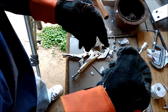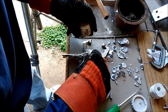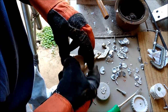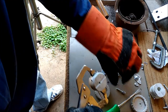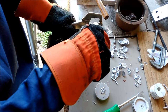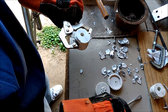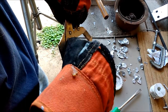I let it set so long that it started to cool off — this one looks like crap. This is my third casting session and my fourth or fifth iteration of this mold. I'm going to have to figure out a way to keep the sprue lid tight against the top face of the mold. That's what's causing that deterioration of the top edge. If lead gets in between the face and the underside of the lid, it starts to create havoc on the top edge of the cavity mouth.